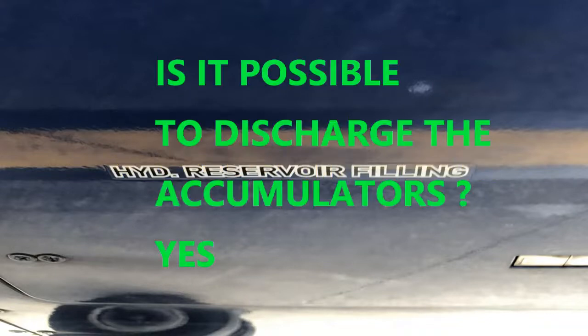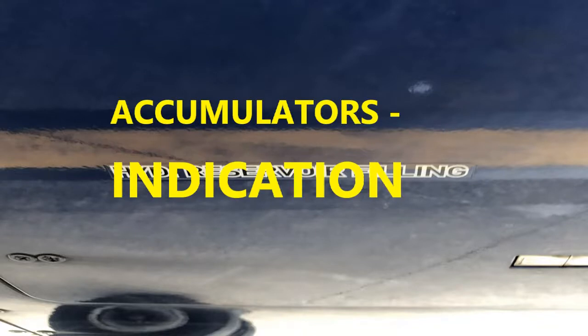What about discharging the accumulators? Yes, you can discharge them. If you're going to discharge for whatever reason, you'll see a safety screw on there — that's just there so there's no accidental operation of the discharge. You'll need to undo that safety screw so that you can discharge. For maintenance, if you're removing that system, be very careful since these things are under pressure. That's how you depressurize the accumulator, and there's also an indication letting you know it's depressurized.